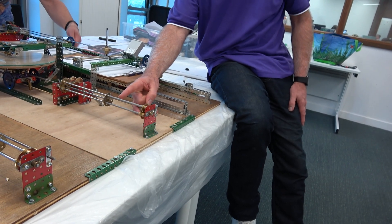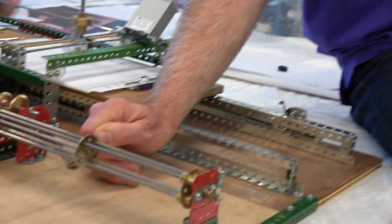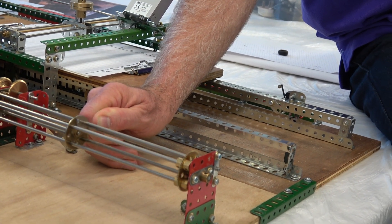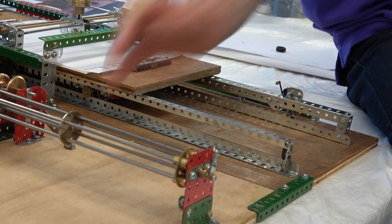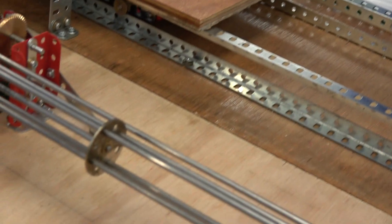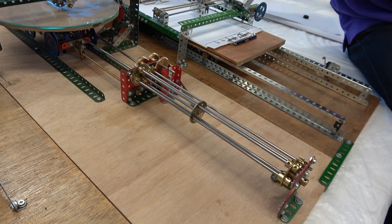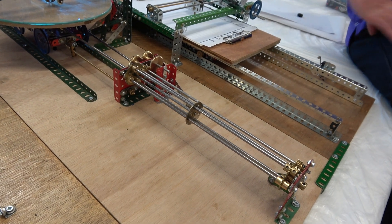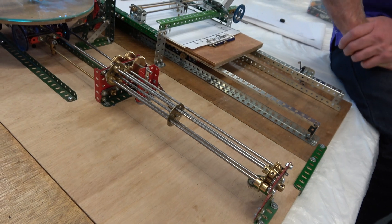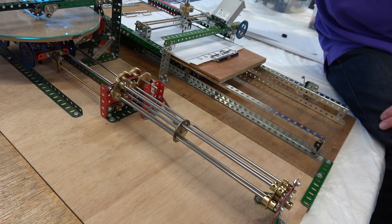If I hold my finger steady, it will come and meet my thumb in a minute. You see my thumb is staying stationary and it's moved past. So that enables the table to go up and down its little railway track here smoothly, whilst maintaining a synchronous drive to the table connected to the rest of the machine. And that gives you the flexibility to keep perfect synchronism whilst the table is in transit.